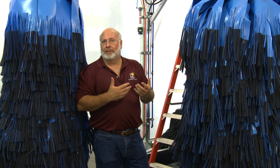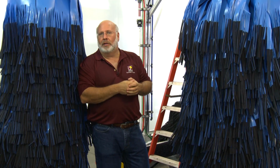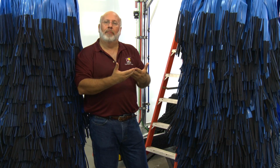If the air cylinder is having a leak or a problem, it's not getting its right control, you'll be able to see that as well. If it's binding, if there's any contamination on the shaft or a bad seal, you'll be able to pull that in, push it out, and identify if that's the problem.